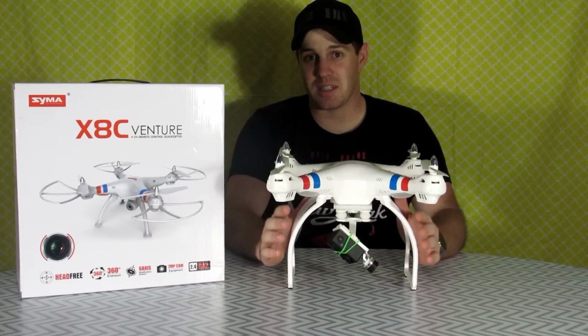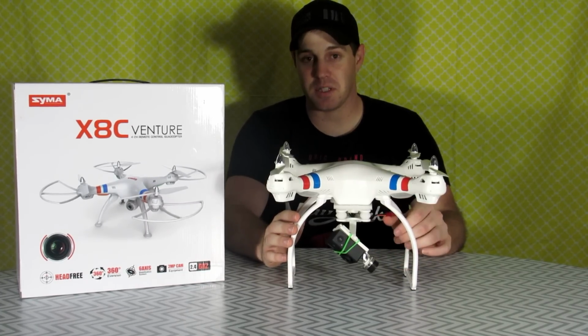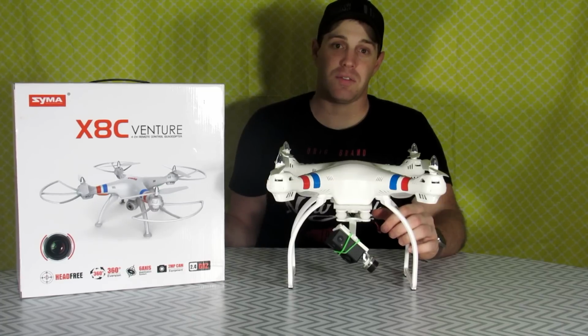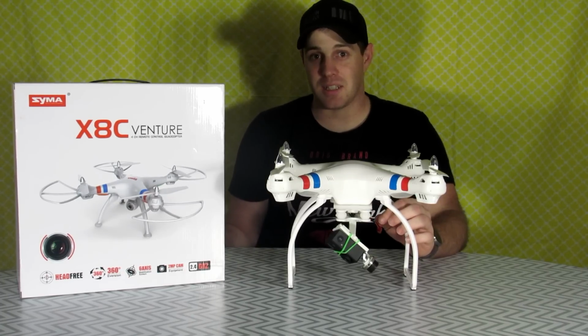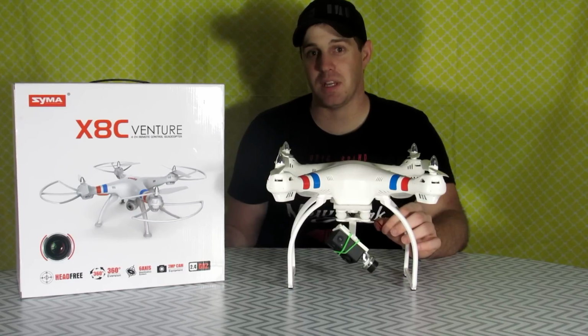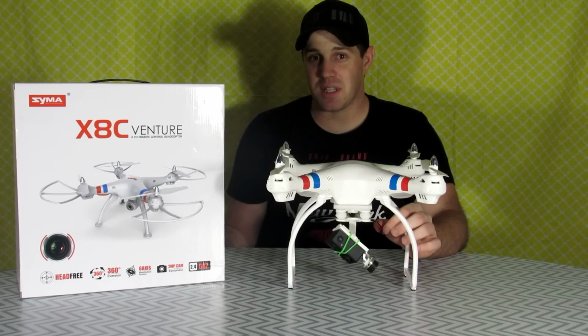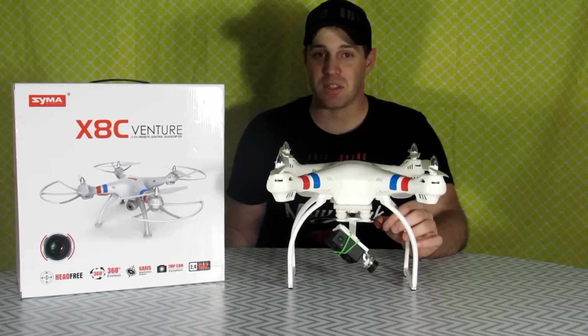After a lot of looking around and a lot of studying, a lot of math, I figured out what I'm going to do. It comes with a JST adapter that plugs into the side of the gimbal to power it. After looking at a lot of reviews, I heard a guy say that he gets 10 minutes of use out of his gimbal on an 11.1 volt 3-cell 150 milliamp lithium polymer battery. Problem is, the more cells you have, the more it weighs. I wanted to stick with a 2-cell setup. The 2 cells are easier to find, and they're cheaper to find in a lower milliamp setup.